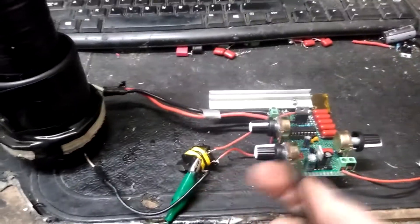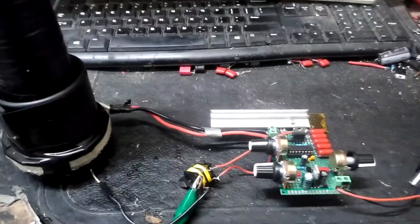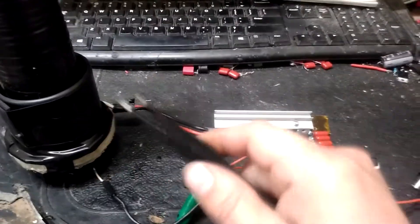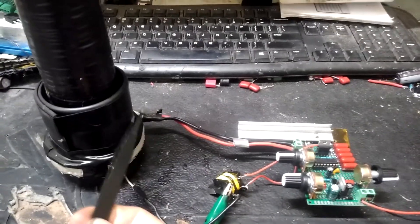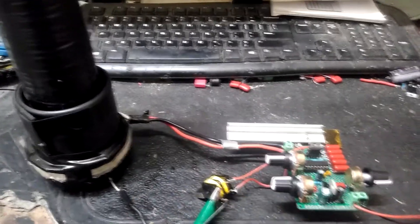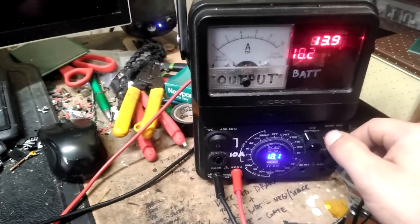With this circuit throwing this test coil on it, the primary wants to sit a little bit higher to get the same beefiness in the arc. With this particular setup running from around 13–14 volts, it's more of a purple arc that pulls out a little further and eventually gets a little yellow in it. If I move the primary up, those arcs get significantly hotter and will get white eventually, but at around 14 volts I'm not going to get anything coming out of the output that way.